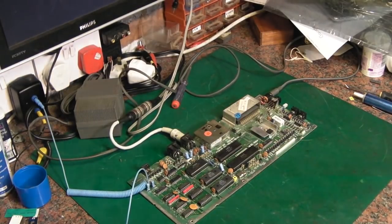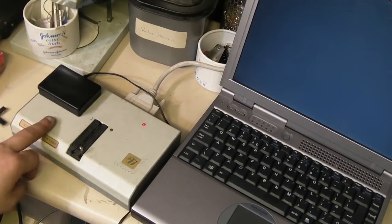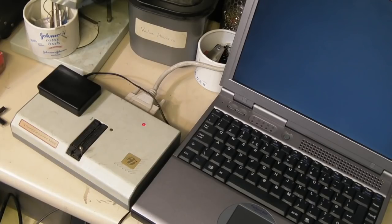What we've got here — I've shown this in another video when I first got it, I've not had it very long — this is an ICS Speedmaster 1000. Basically it's an EPROM programmer on steroids; it's not just an EPROM programmer, it does many many things. It's a fantastic piece of equipment — I am over the moon to get hold of this thing. It will program EPROMs, I think it can program PALs and GALs as well. But the most interesting thing is it can actually test many different types of ICs used in these old computers: it can test the old 74-series logic ICs, it can test SRAM, and it can test DRAM.